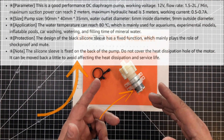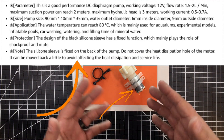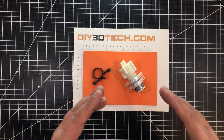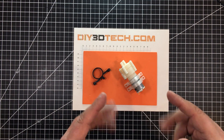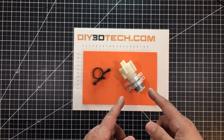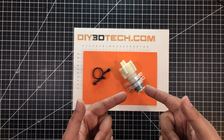This is a 12-volt DC powered pump that moves about 1.5 to roughly two liters of water a minute, which should be adequate for general K40 usage. Remember, we're basically just cooling a 40-watt light bulb. I needed a way to mount this to the K40 laser itself, because this will actually be powered from the K40's power supply. So when I turn on the K40, this pump will run.